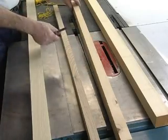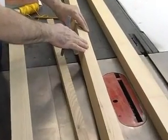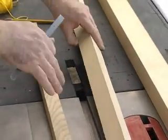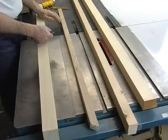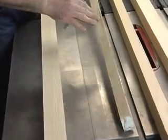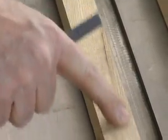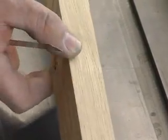Before we go further — write down the species of the wood. Until you know them by heart and you're working in maybe not the greatest light in your shop, it's great to just mark an S for spruce and an A for ash, so when you put the piece back on your wood storage bench you know exactly which one it is. Here's a piece of ash we started cutting and planing to make longerons, but when we got into it there was a flaw in the surface, grain that wasn't going straight, and one of these little bores — so this piece is pretty much unusable.